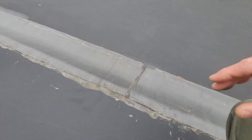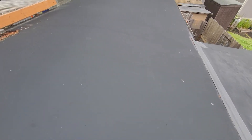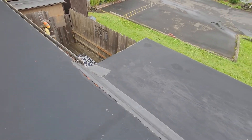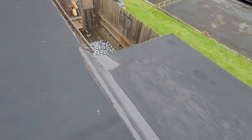We would recommend an evaluation by a licensed roofing contractor with recent demonstrated experience managing such challenges. All around this roofline, we're making note of soft spots. That could be because this roof was laid over the top of the original metal roof. However, without having access to those areas, it's not going to be possible for us to determine exactly what the condition below might be.